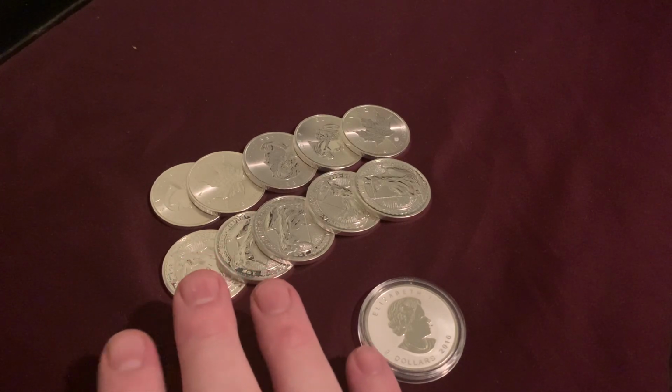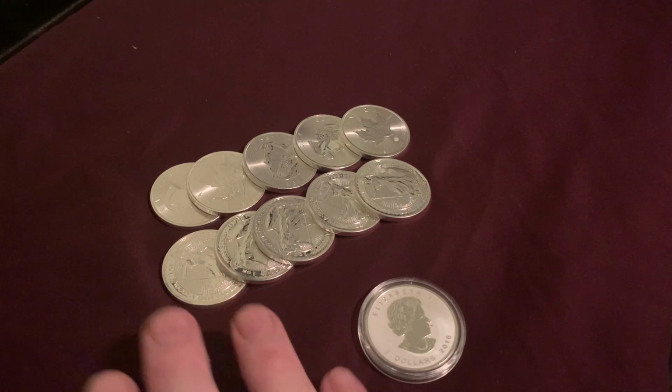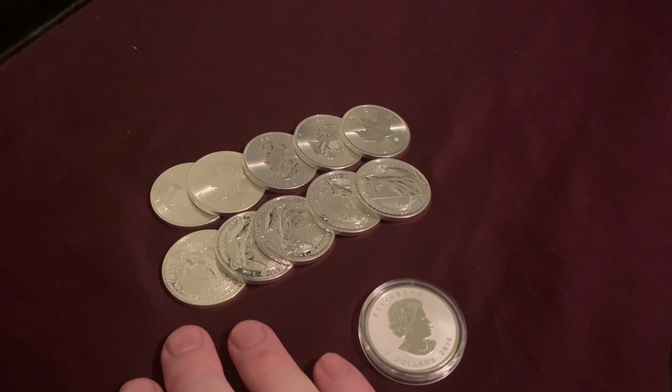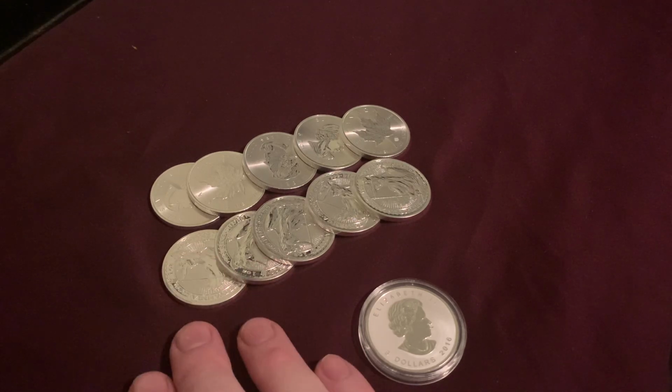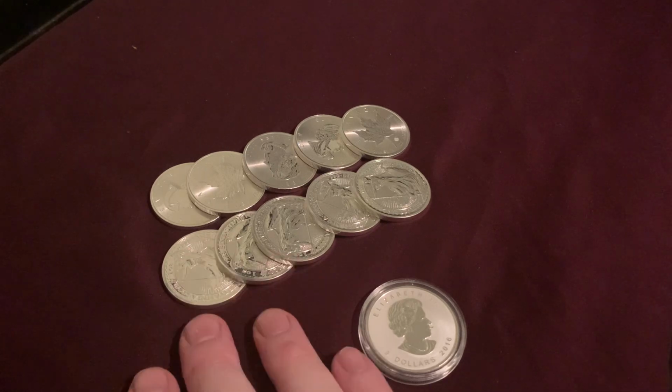Once they're done being struck and punched out, they go into the polishing machine, get machine polished, and then they keep going on their way. Here, they need to be taken out and hand polished. So that's, again, more of the craftsmanship, more of the expertise that goes into each coin. And with the mass production line, they're only getting struck once, and it's a very high speed operation. I believe they said 650 coins per minute are struck and made.